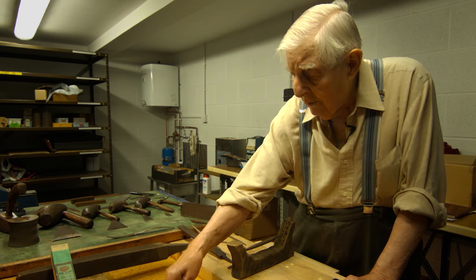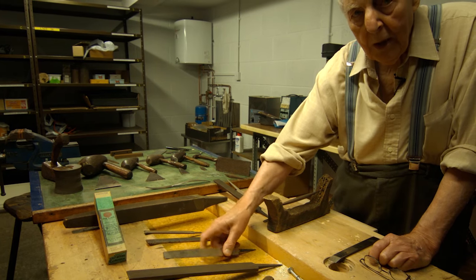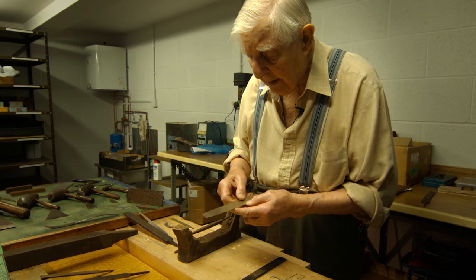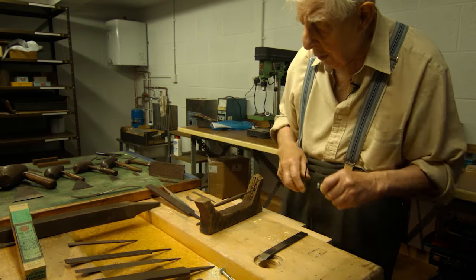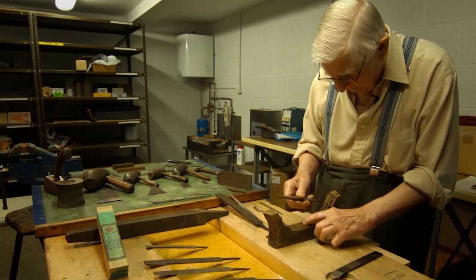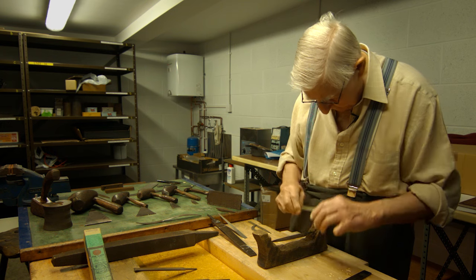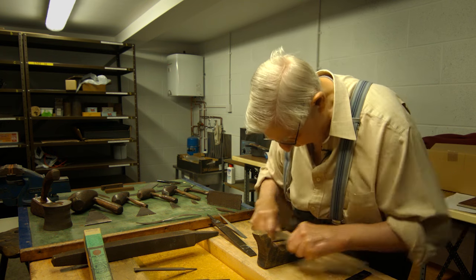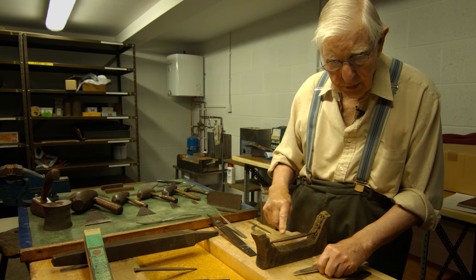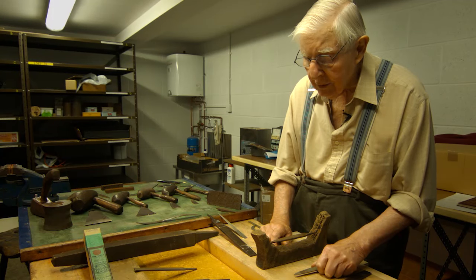The flat surfaces are not normally quite flat, and in order for the surface of the blank to be perfectly flat for cutting the teeth, the operation is what's called stripping. What happened in the old days: they got a file that had been ground and put it in this stripping frame — which you can see is just a block of wood — and the file blank is held in there and rubbed backwards and forwards. By that means, the surface remains entirely flat across its width, so the file teeth are cut equally on both sides. That's the stripping, which is the process immediately before cutting.